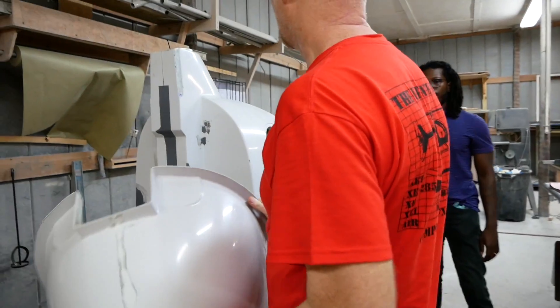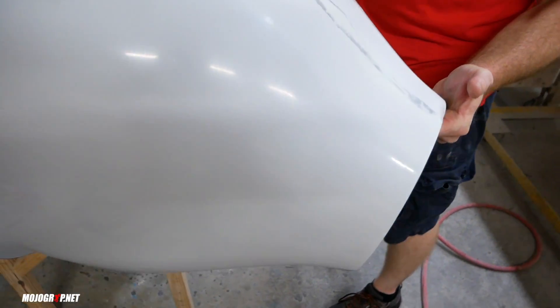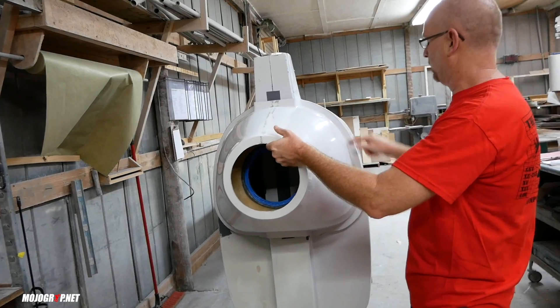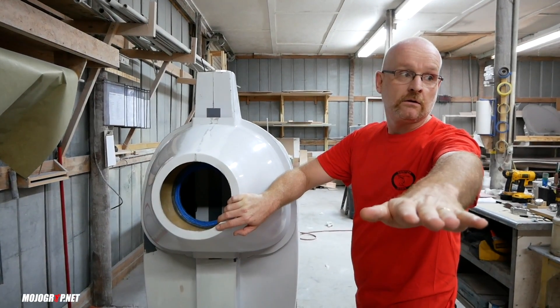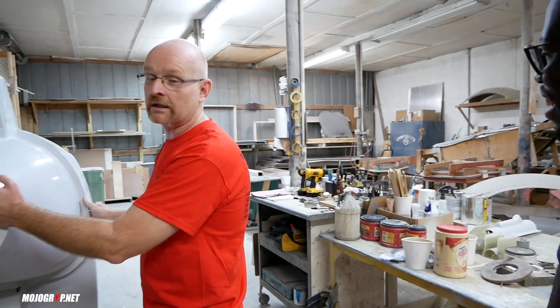There's a 12-gallon fuel tank. This fuel tank will be assembled to the airframe — it's a structural component. It'll be epoxy bonded and riveted to the airframe. At this location the tail boom will hang as well — the piece we saw picked up that's so light it was almost thrown across the room.